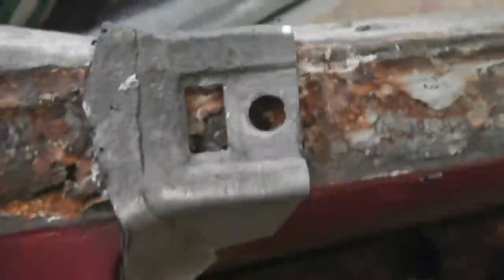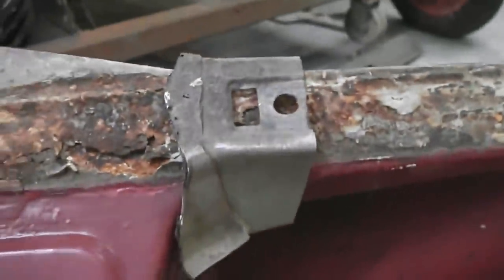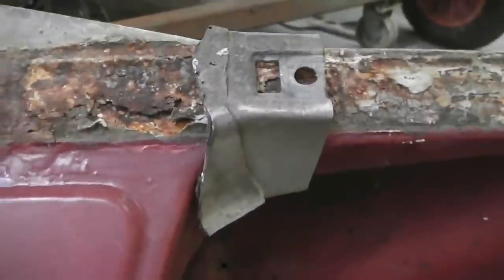so that you cut off a little bit more than what you need, which hopefully allows for a fully butted up join, which will hopefully follow the profile, so that there's less spacing and plugging to do, less bridging with your welder to try and fill in gaps, or trying to put in bits of metal because you've undercut. Sorry, if you've overcut, you'll be overlapping.